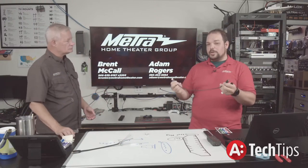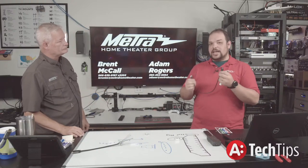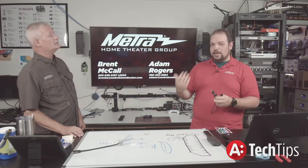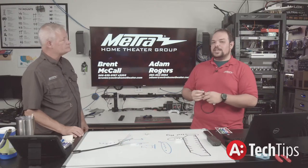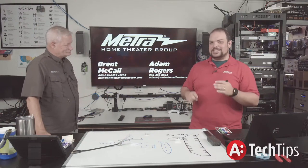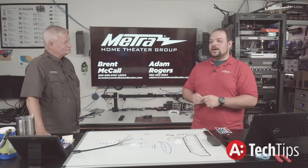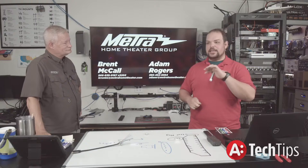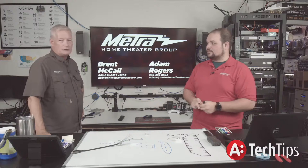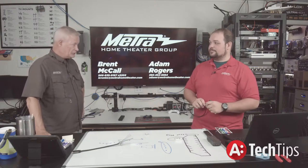In most cases, when you're using a thin cable inside of a rack, you're going to be okay because of short distance, and in most cases you're going into professional equipment inside that rack — a matrix or an AVR — that is not as quick to give up the quality of the power supply. Many display manufacturers, however, are more quick to give up those power supplies, because their assumption is you're going less than three feet from your display to your source.